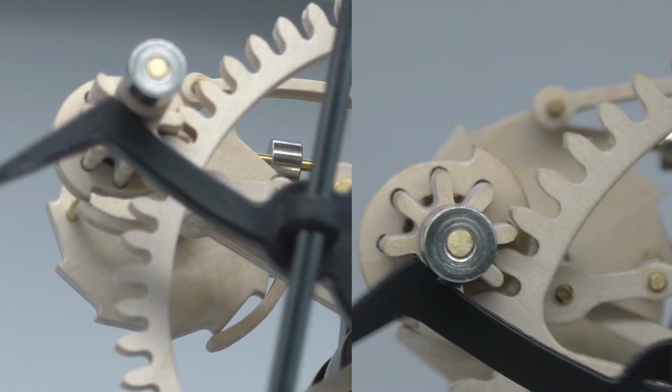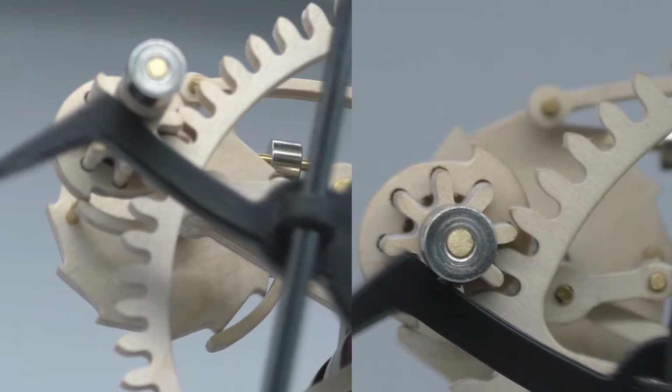When the trigger has been lifted by the count wheel, the drop weight falls and closes the gap between roller and impulse arm. Here you can see that the trigger has fully disengaged from the trigger cogs. If the gap between roller and impulse arm is insufficient, then the trigger will not disengage correctly and the drop weight will not be free to impulse the pendulum.